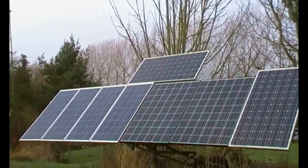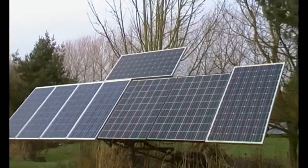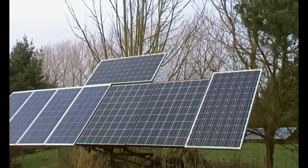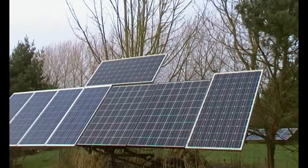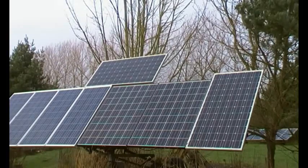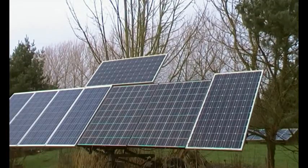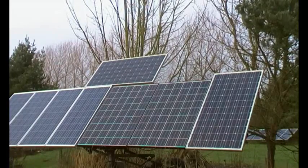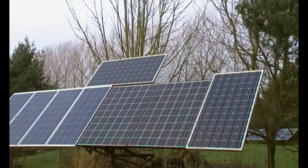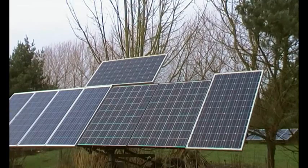And the solar boom is made up of 4 12 volt panels on the left. They're 140 watts each. Then we've got a motley collection here. The one on the right plus the one on the top are 190 watt high voltage panels. They're something weird like 38 volts. And the two in the middle, the squarer ones, are Kyoceras, but they're 200 watts, but they're 26 volt, so they're a little bit low, whereas the other ones are a little bit high. So we have a high voltage and a lower voltage panel in series, so there's two pair there. The problem being that the high voltage panels are only 5 amps, so each pair of panels is limited to that current. 1300 watts, that's a bit of an approximate.